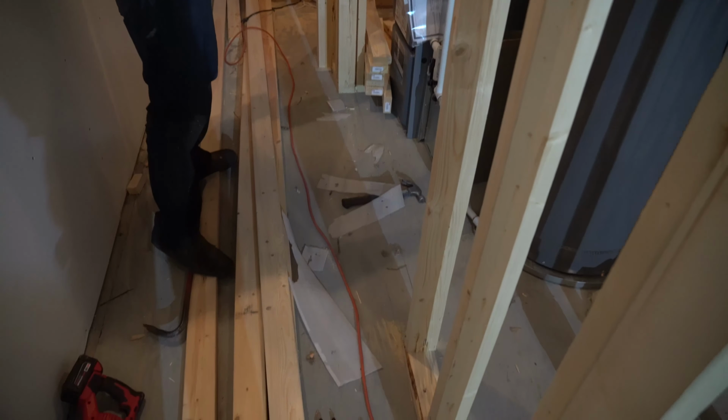So we got to drop the ceiling, and this is going to be the fun one. We have to make another bulkhead. If you look up here, we have to kind of bring this out here and brace it, because we have to go up here and clear this ductwork, because it's within 6 inches of this. So we're going to bring it out past this ductwork, and then we have to bring it down and across there. So you can kind of see this. This is going to be the edge of it. After we build this piece right here, bring it down to that pipe. That pipe is going to be its own separate bulkhead. So our drop ceiling will have a nifty little bulkhead that goes into a bulkhead over here, but it'll be much higher.